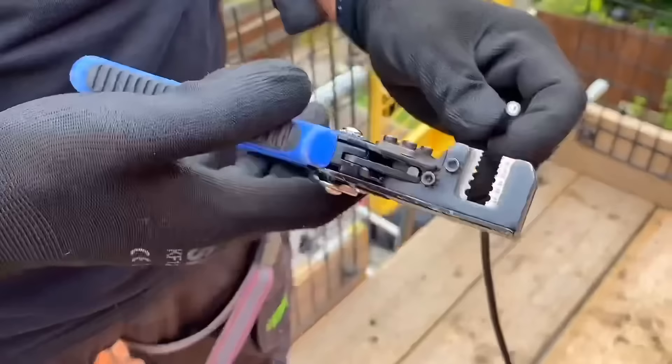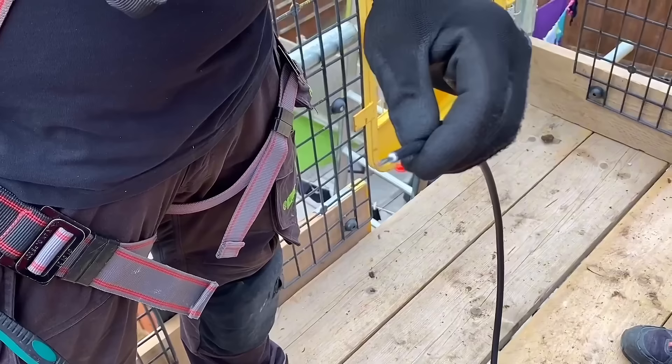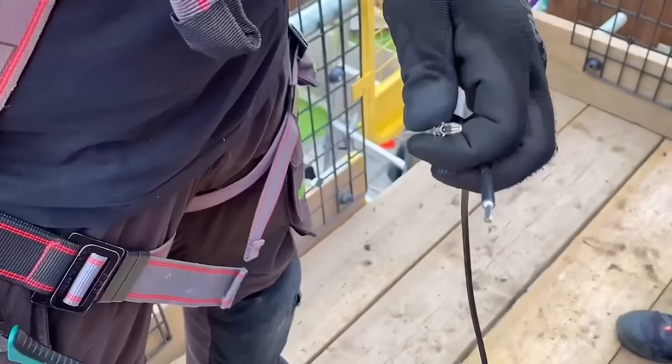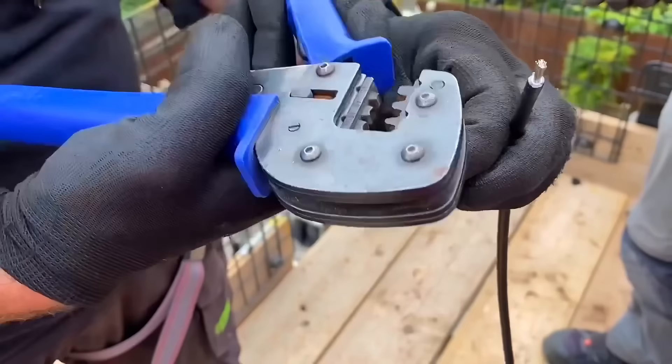So first thing? Strippers — dedicated cable strippers. Well, there must be a required length for that. Is that just because you've made so many of them off you've just grabbed that length straight away? Yeah, so there's a certain length for that. Which one do you do first? We'll do the positive. It's the easiest way of doing these because they're quite fiddly, and potentially sometimes these might actually be live as well. So obviously we're used to crimping tools — what sizes do they do? 2.5, 4, and 6 mil.